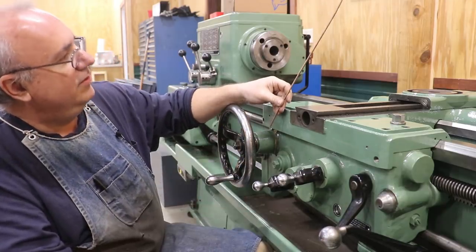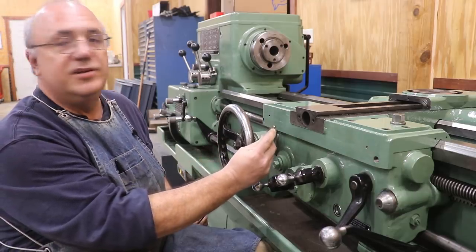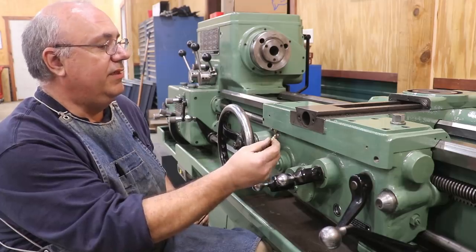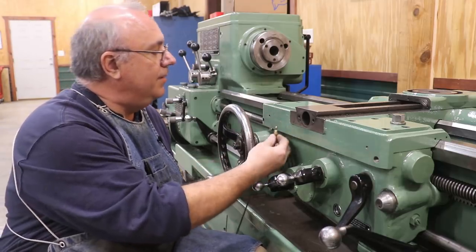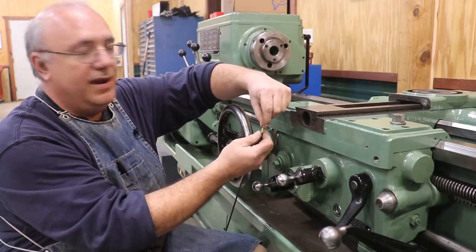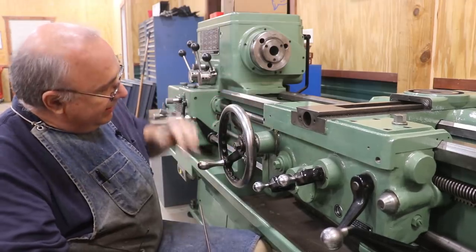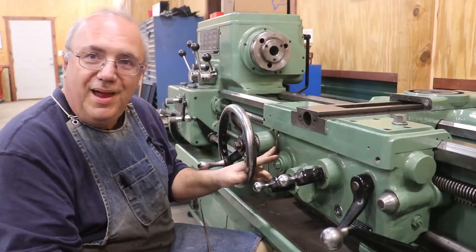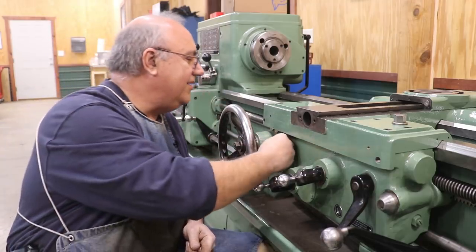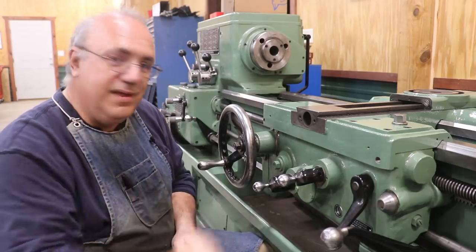It's very cleverly engineered, but we had to get this tube put in here. I just cut it off to the length — this was the extra that was on there. It's just a little compression nut with a little brass ferrule in there. When you tighten the bottom piece up into the plug in the bottom, it compresses the ferrule and makes a nice oil-tight seal. It was a little aggravating — this steel pipe doesn't bend very easily, and trying to get it to the exact right length took a little bit of fiddling, but we got it. The oil system is ready to go; I should be able to put oil in here and it should start pumping as soon as I do.